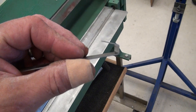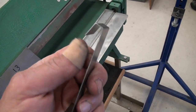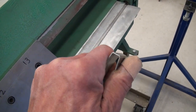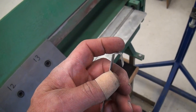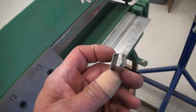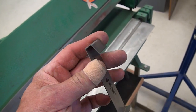It's a piece of sheet metal that's not a complete 90 at the top. And you can squish it or try to push those two pieces together, but one of two things are going to happen: you're either going to bow the top part out, or you're going to make the radius on the back side of these two bends larger. And the part won't look that good.